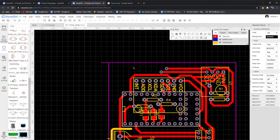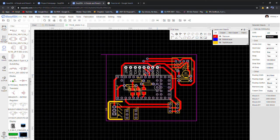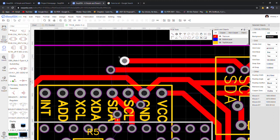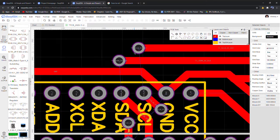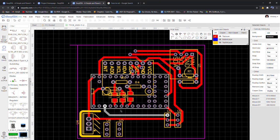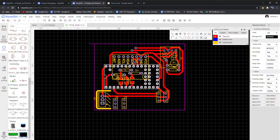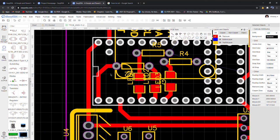Okay, I think this is going to be pretty much the final layout of the board. It's a little messy and a little difficult, especially with the big traces and the one-sided board. Typically, we would use a two-sided board to avoid these little gaps that we have to cross over with wire, physical wire, not just the traces. So I have to deal with that, but I think it's simple enough that I can draw it out on the board and get it done.